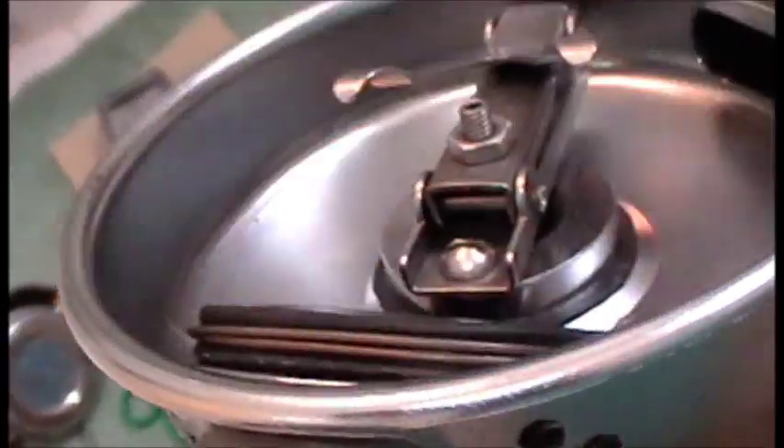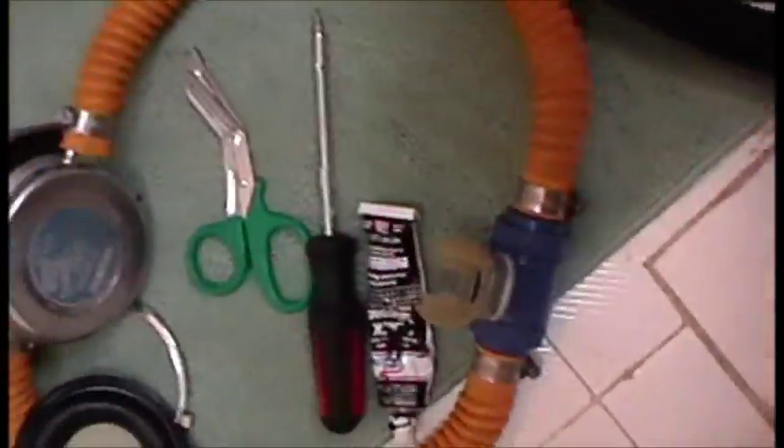Everybody says they're a hard breathe — well, maybe you need to get yourself in shape. The main thing is: with the new silicone main diaphragms, remember they were set for the older diaphragms. The silicone ones give you a little more play. You want those two levers right next to the diaphragm — maybe even a little bit higher than you would with the original — so when you push down you should feel the lever right there. If you leave it at the original setting you'll get what we call valve flutter, and that's not good.